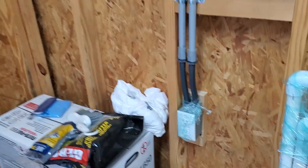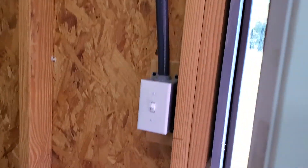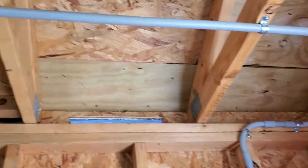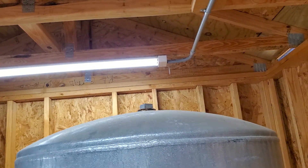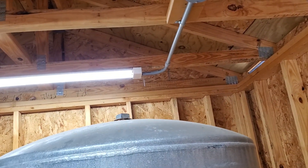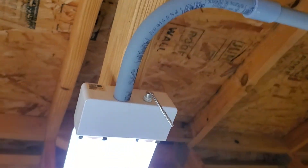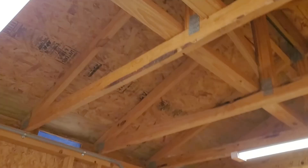Let's go over the electrical. The light in here comes up and goes down to a GFI plug, out of the GFI plug to the light out there, and then a switch. This comes over to the control panel for my well. These lights were at Costco — they're just LED drawstring lights. They're supposed to plug in, so I took and cut the plugs off, ran them into this j-box, wired them all together, brought the Romex in, and wired into the Romex — left the lights on. It's a pretty tight little fit; it just butters right up against the end like that. On each side it's a pretty clean install. I was pretty happy with it and it makes it plenty bright in here.